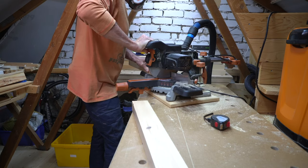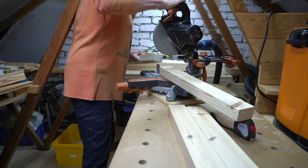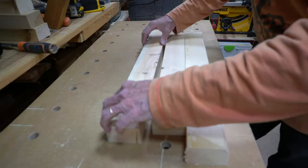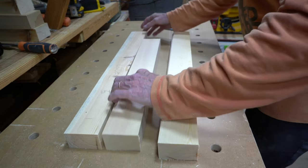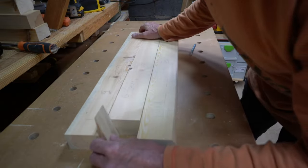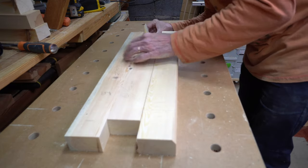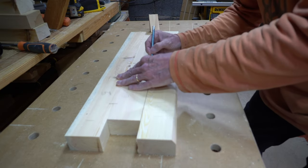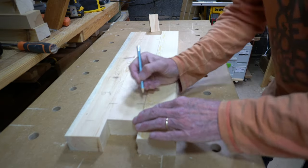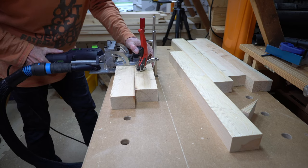Moving on to the seat / bench top, I cut 6 plain pieces of timber to length, and as I was going to glue all these together, sorted them to ensure I had the best joints. Note, the middle piece is shorter than the 2 outer ones, in fact it is shorter by 2 times the thickness of the legs. To join all these together, I thought I would also insert 6 dominoes using my new machine.